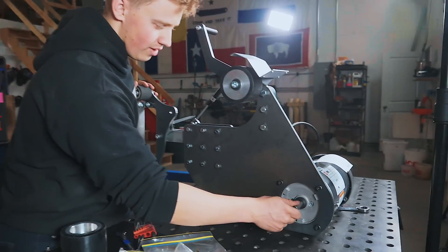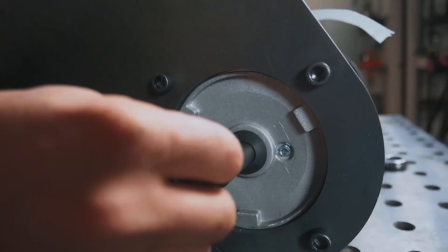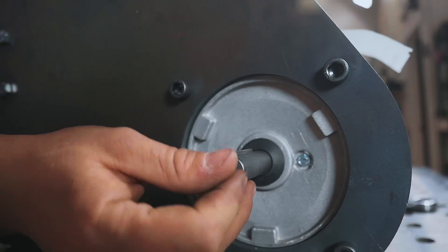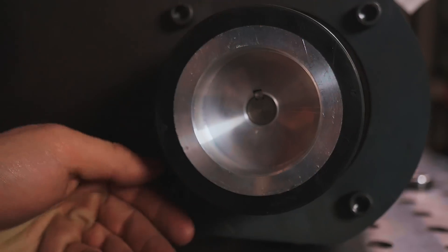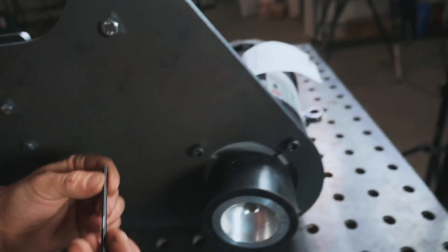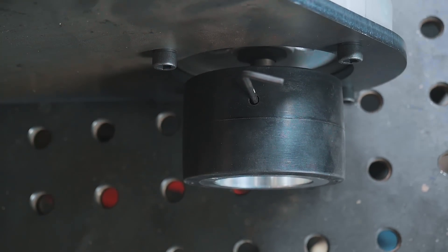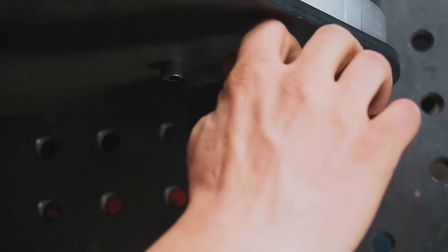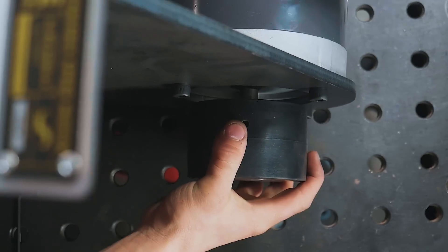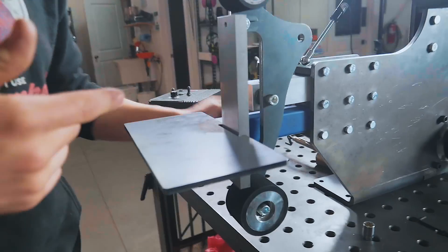One last step: take the little key off the body of the motor — it's going to sit snugly inside the keyway — and line up the keyway inside the drive wheel. Watch your thumb in there. Lastly, take an 1/8-inch allen wrench and line the wheel up so its edge roughly lines up with the outside of that bolt, standing off about 3/8 of an inch. Get the grub screw tightened down inside there; that holds the wheel on so it doesn't come flying off.